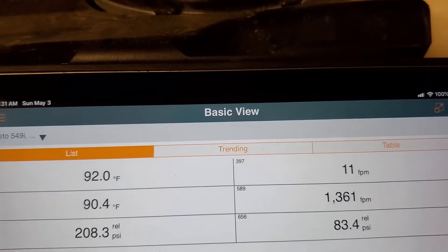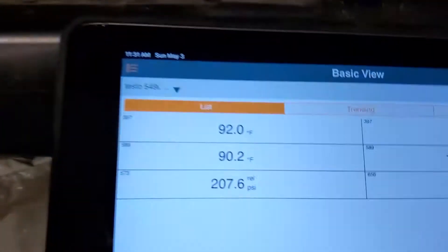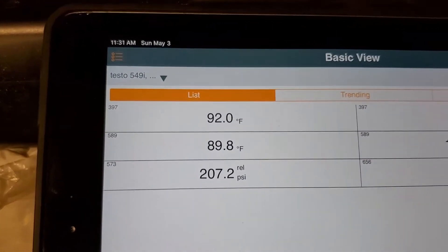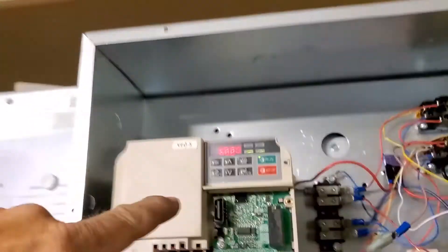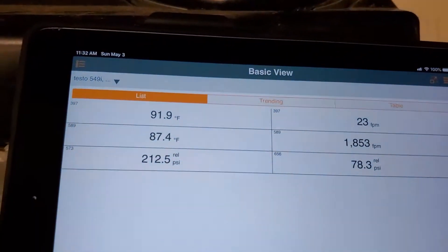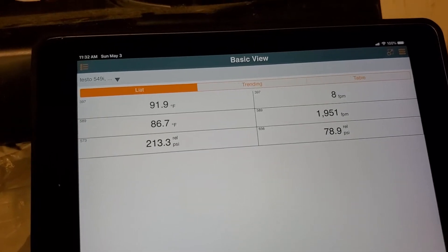Right here it's getting cooler now. It has a thermistor built in but it's slow — it's not fast like the other one, but it will give a temperature reading. You can see it's already dropping. Water temperature is 86 in the tank, says 67 there... 95 even. Oh, it latched second stage — jumped up to 60 Hz, fan speed jumping up. I had about a minute delay — that's cool.